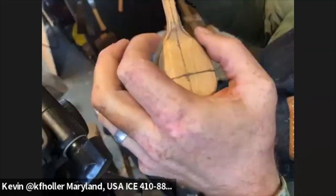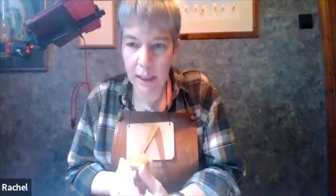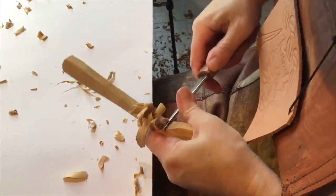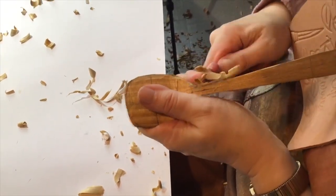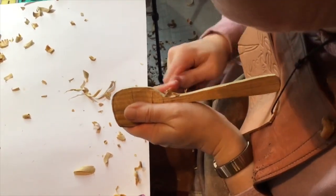So would you do these neck parts first and then around the rim? Yeah. I would do one side neck part into handle, and then I tend to go to the top of the bowl on that side as well while I'm thinking about it, and then go for the other side. And this is the point to remember that you're going to the pencil line and you're not going to give any space. Yeah, split the pencil line like a boss.